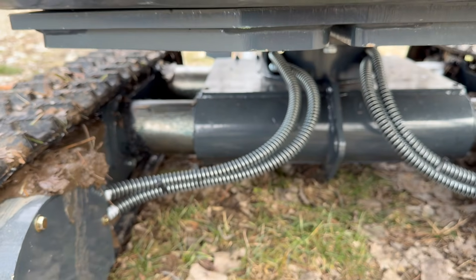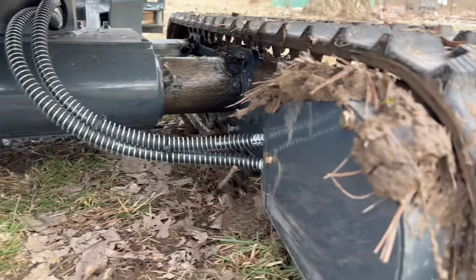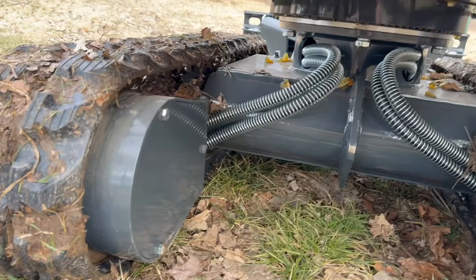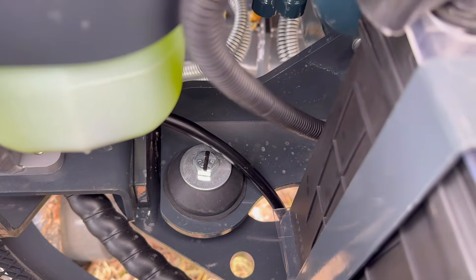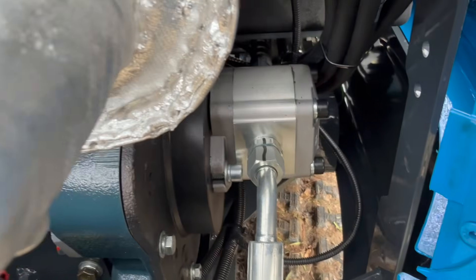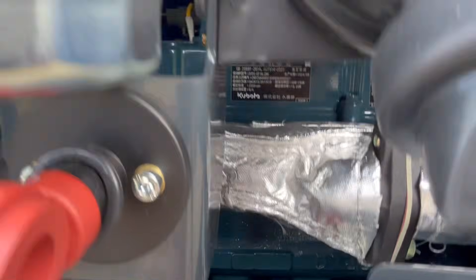The undercarriage on this one has protected motors, so there's nothing hanging out to get caught on rocks. This one is expanded currently and this one is not. The R10 motors are just like the R15 motors — they're protected, not sticking out. One thing to note: most of the bolts on here are paint-marked, so you can tell if they're loosening up. Same thing with some hydraulic lines — it's all from the factory. Same thing on this machine: paint marks all over the place, better quality control than most, but you pay the difference.